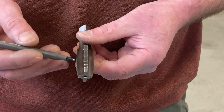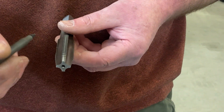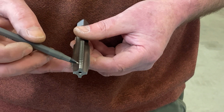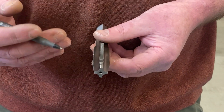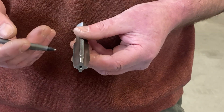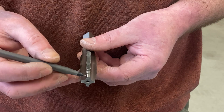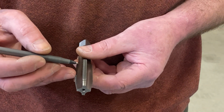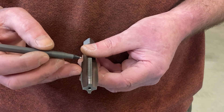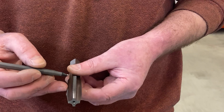Now the question specifically was: how much, if any, progressive axial relief do we put on a tap? The manual that came with my cam relieving fixture — my progressive relieving fixture — did suggest that there was a small component of axial relief used when grinding taps. It did not specify exactly why that was, but I have a really good working theory, so I'm going to sketch that out and explain it as best I can.